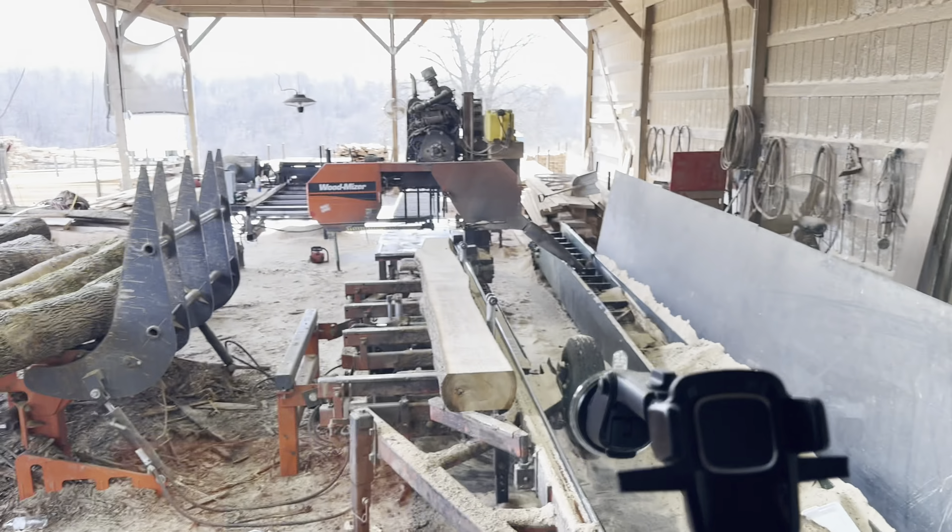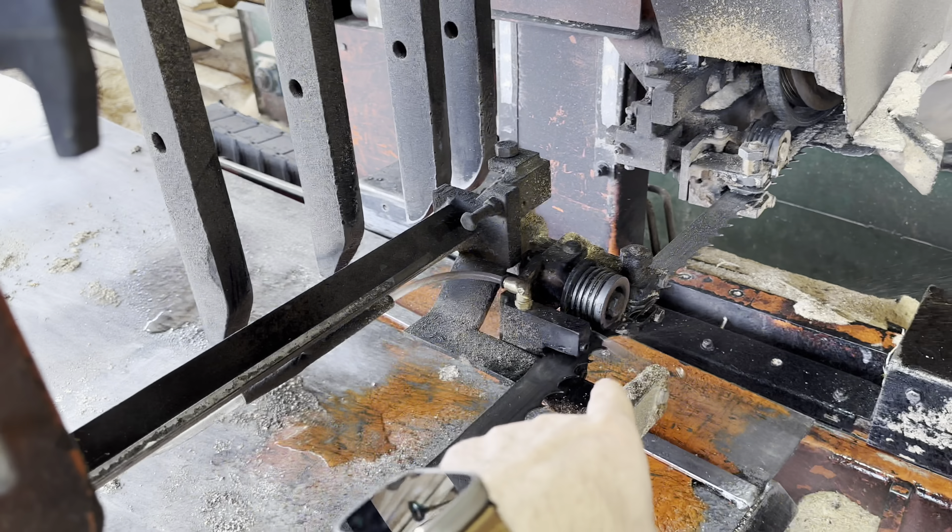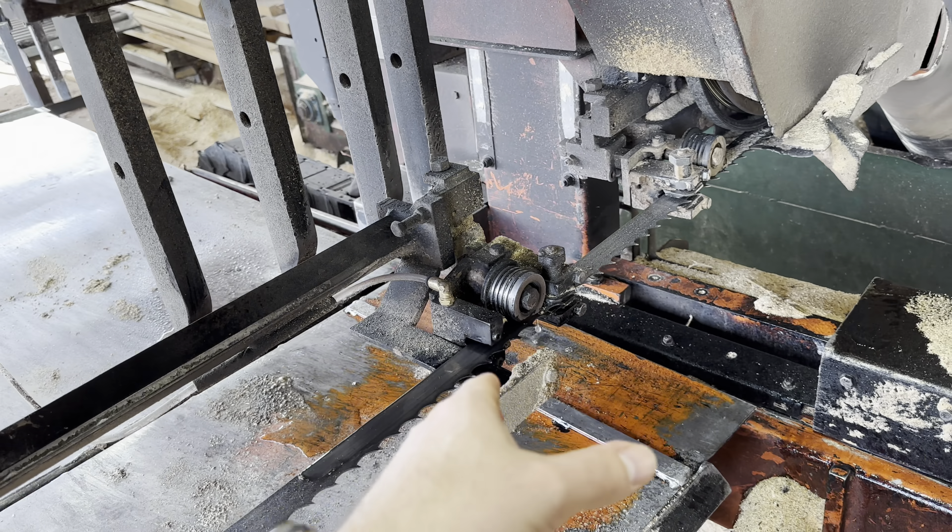See, my lube miser's kicked on. It still says 'engine must be running' — you can see it shooting water out there. That bypasses you having to start the mill. As you can see, I don't have it started at all — the mill's not running. What that gives you the opportunity to do is go out here and hear that the pump's running. If you're over here and your nozzles aren't squirting, you can see which one is not squirting.